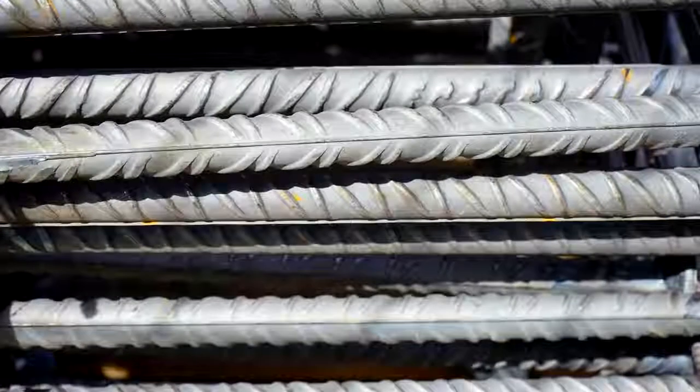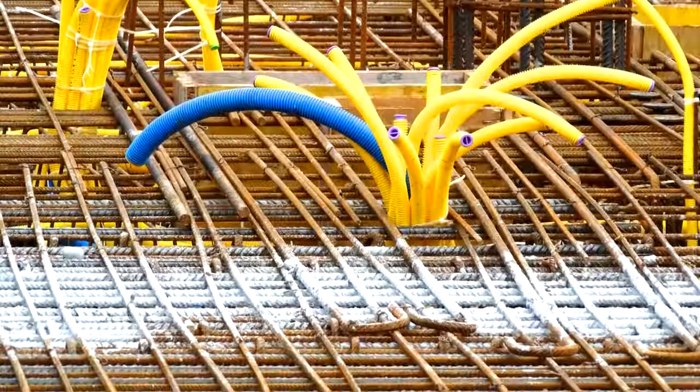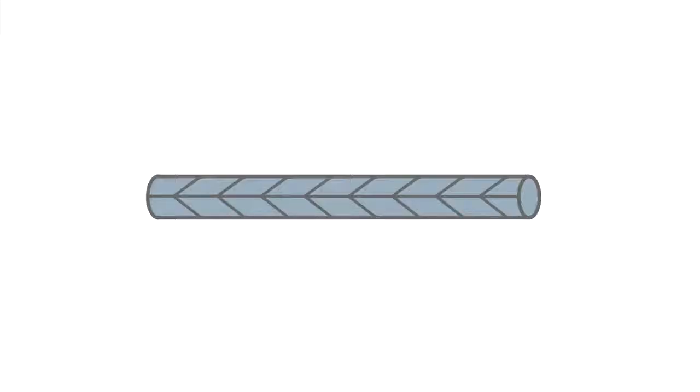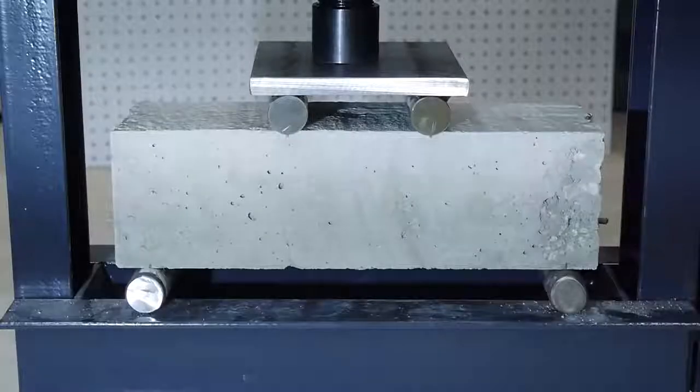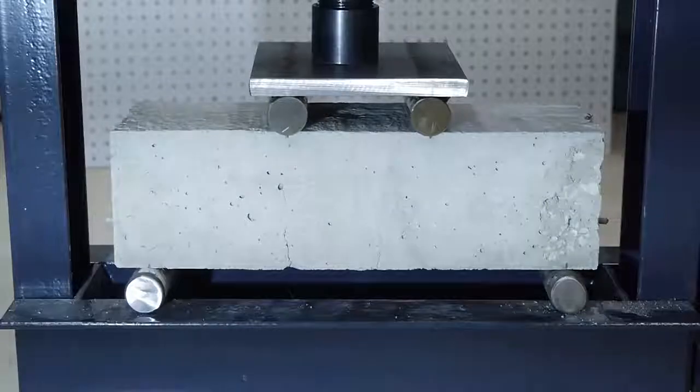This is actually a very important part of reinforcing concrete with steel — it changes the type of failure from a brittle mode, where there is no warning that anything is wrong, to a ductile mode, where you can see the cracks forming before a complete loss of strength. This gives you a chance to recognize a potential catastrophe and hopefully address it before it occurs. Rebar works great for most reinforcement situations — it's relatively cheap, well tested, and well understood. But it does have a few disadvantages, one of the major ones being that it is a passive reinforcement. Steel lengthens with stress, so rebar can't start working to help resist tension until it's had a chance to stretch out, which often means the concrete has to crack before the rebar can take up any of the tensile stress.